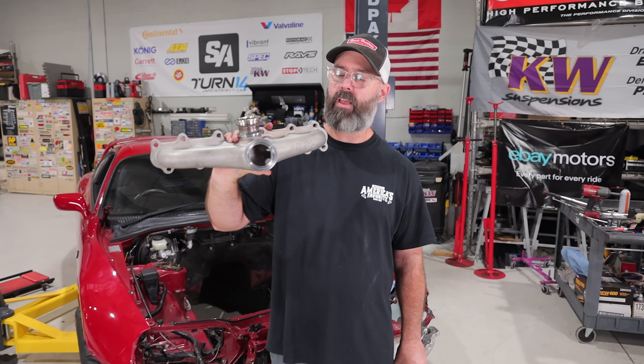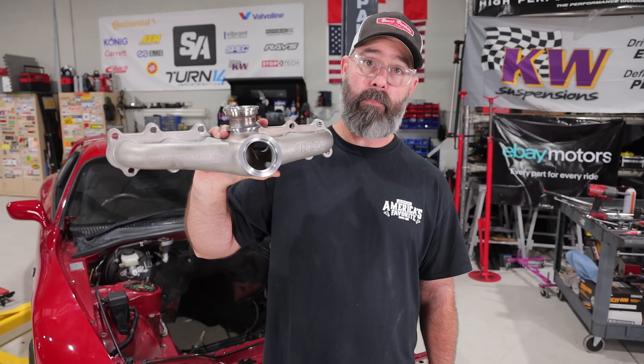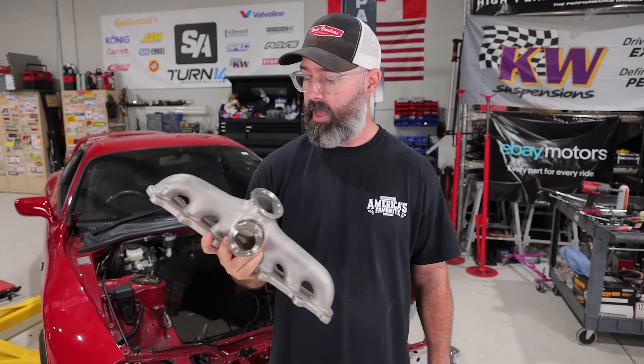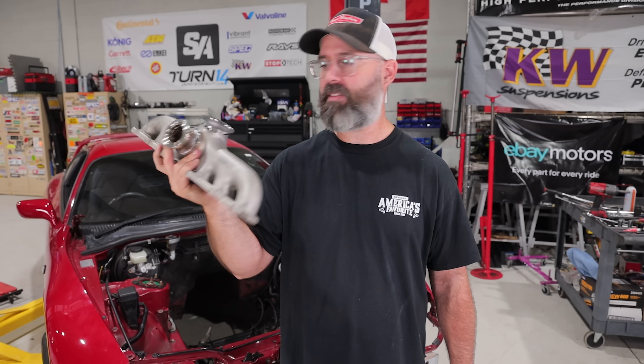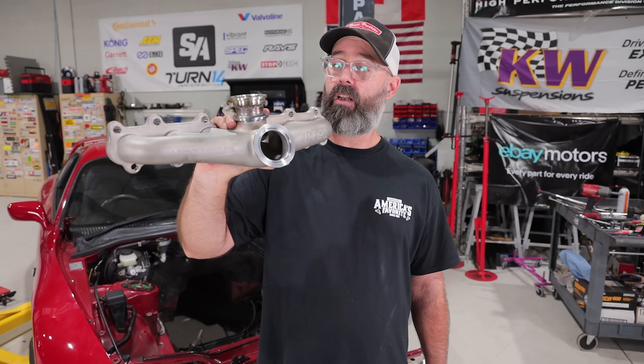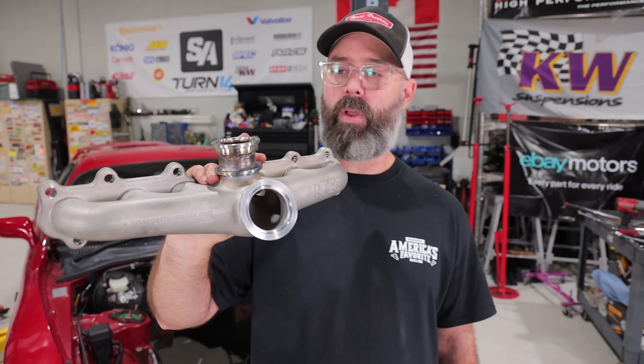Before we end this one, we've had a lot of people asking about where to get these Artec performance manifolds. If you're in the USA, you can get them at Drift HQ, which coincidentally is now owned by world-famous YouTuber Adam LZ. So you'll not only be supporting this really innovative manifold company out of Australia, you'll be supporting one of our favorite YouTubers. And of course you're getting this really compact cast design, which is very durable and just makes life so much simpler with all the plumbing. This little extension that we put on here is only necessary if you're running a big turbo and a Tial wastegate like we are. But Bennett at Artec is now aware of this issue and can accommodate you no matter what combo of turbo and gate you're running.